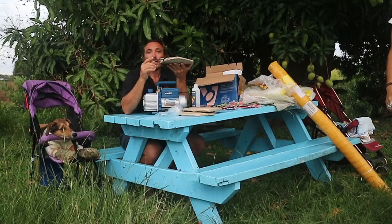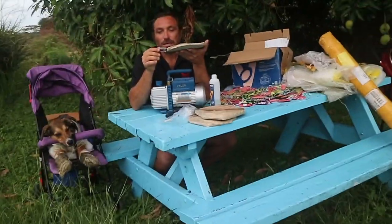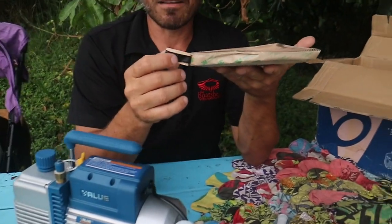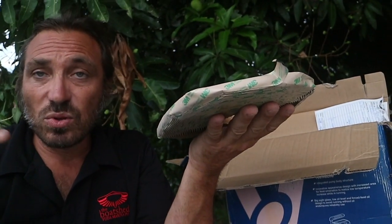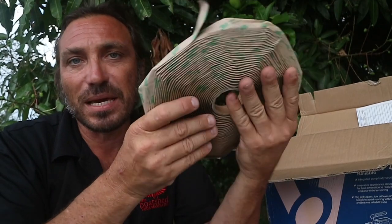It's a very sticky material, it looks like liquid, but please don't eat it because it's not very healthy. It's like plasticine — you can stick it all around the job you have to do, then remove the backing. You use this tape to stick in place and seal the vacuum bag on top of the area that you're laminating.